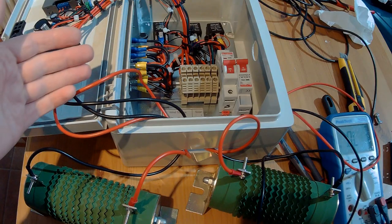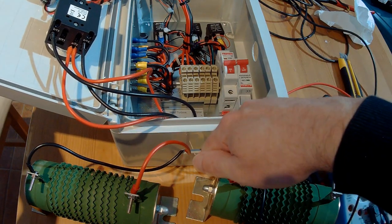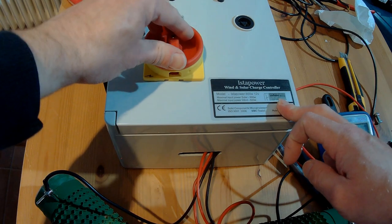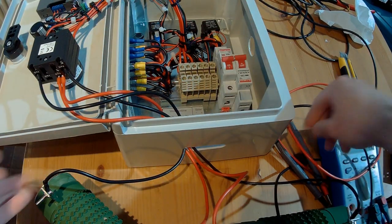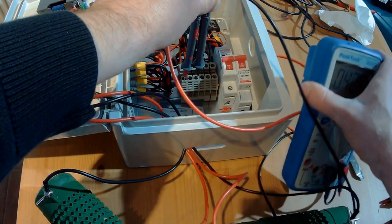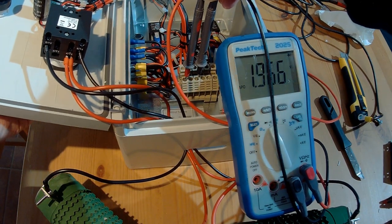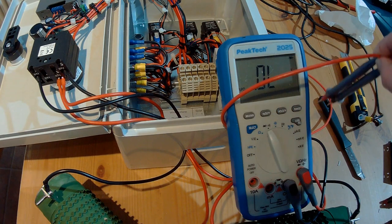As you can see, I've now added these two dump loads — the wires run through a hole in the housing, you could drill another hole and close it up neatly. The functionality is the same as before, but now the dump load is on the brake. If you measure this with the multimeter, you can see the functionality is identical — the only difference is the one ohm resistance of the dump load. With the brake off everything is an open line, and with the brake on you can see the one to two ohms of the dump load.